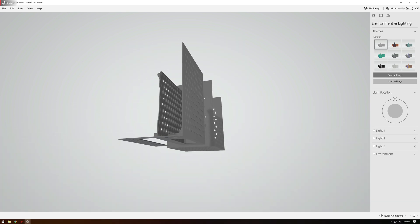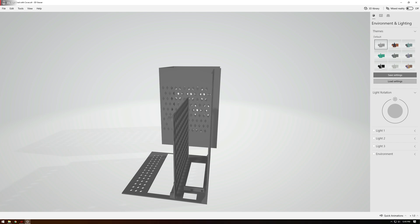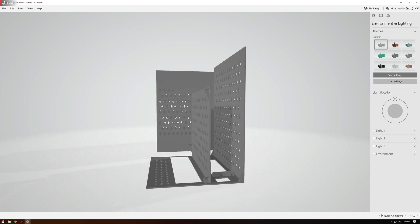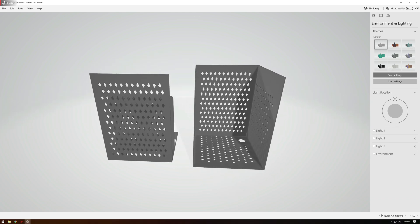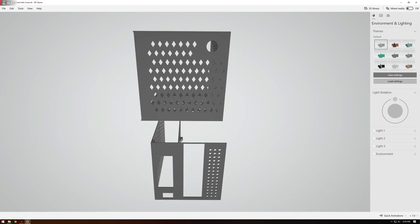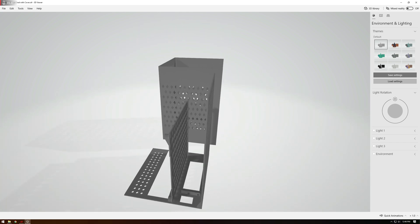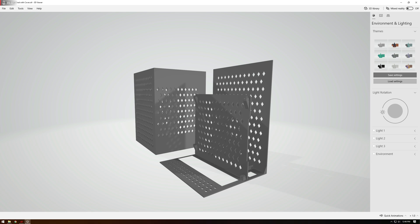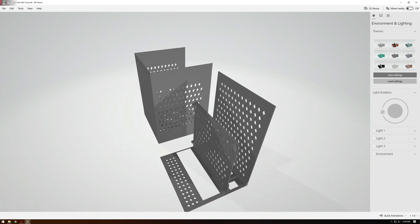This is what I came up with in the original design, which looks pretty similar to the first one. The biggest additions are extending this piece to hold the 70mm CPU fan, adding brackets to hold the GPU, and a pass-through for the PSU cable — though there wasn't really space for the PSU itself, and no mounting holes. I also designed a simple top case with a pass-through for the power button. Following advice from Reddit, I realized the narrow beams here weren't going to be strong enough as load-bearing elements, so I scrapped this design.